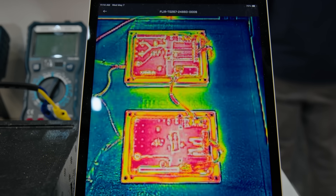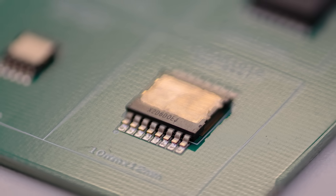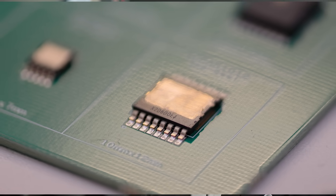This is what we're showing here — the difference between traditional cooling and cooling with a top-cool system. With 0.42 milliohms, that is 420 microohms. Every screw, every little wire, every contact has more resistance than that. So we are talking about a really crazy low amount of resistance, which translates into a very low amount of power loss.